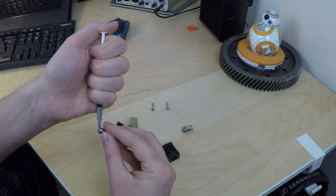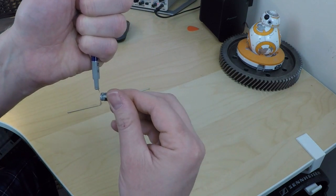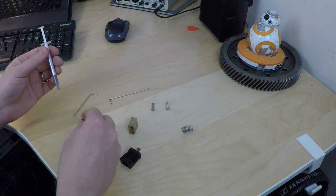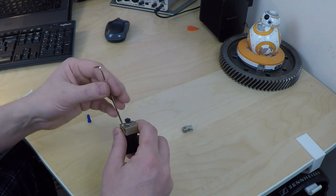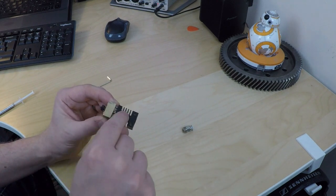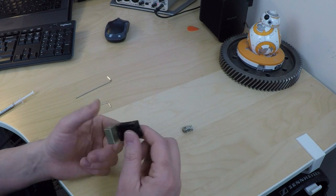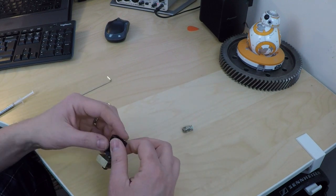Release the shmoo! You don't need much of this stuff, but because I'm trying to close up a bit of a gap I'm going to put a fairly thick coating on. Now we've got the heat transfer compound on — this should keep that side a lot cooler, let the heat get taken away, and keep the nozzle end a lot warmer. Top tip: before you snug the nozzle all the way down, warm the hotend up to about 240–250 degrees, because the block is going to expand and otherwise it'll come loose. Bitter experience.